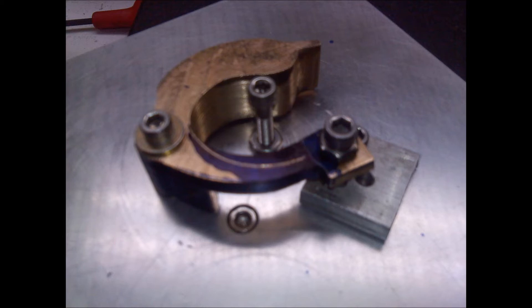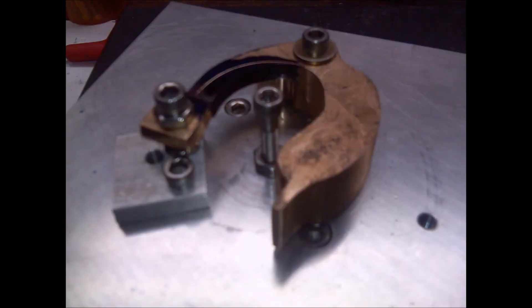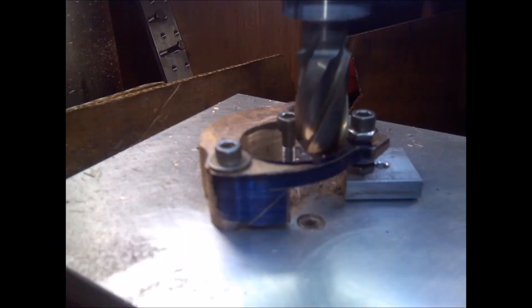The blue area with the arc on it — that's the edge of a 45-degree ramp that had to be cut into it, and I'll show that in detail in a couple of slides. I used a little homemade machinist jack just to hold that arm and keep it from wobbling or going into harmonics when machining it.